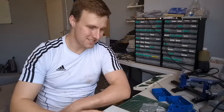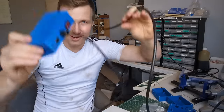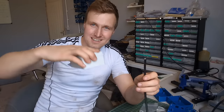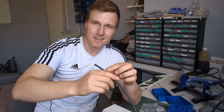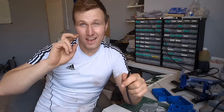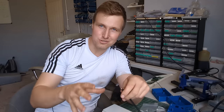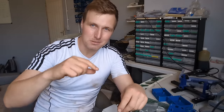We are nearly finished. We have our controller, we have our cable with our waterproof connector. Now this is a 7-core cable and it goes in to this box. This box is going to have 5 cables coming into it. It's going to have power, our controller cable, it's going to have 2 relays, one for the automatic drain valve, the other for a shut off on the feed line, so when it's draining we can also pulse the feed line to fully rinse it out, and then one final cable for the flow meter.